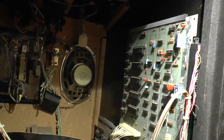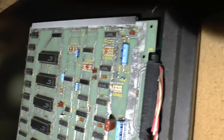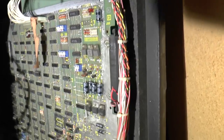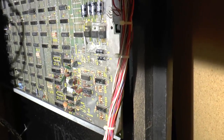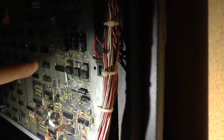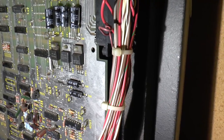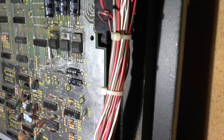I do see a bunch of other capacitors on the main board. I don't really see any corrosion next to them — there's a little bit right over here. Those are supposed to be heat-synced in there; they just look like they're hanging on there. And that's not great, because they're regulators. I see a 7915, 7805, and a 7815 — that's plus and minus 15 and plus 5 volts. There does appear to be something about negative 5 volts on there also.